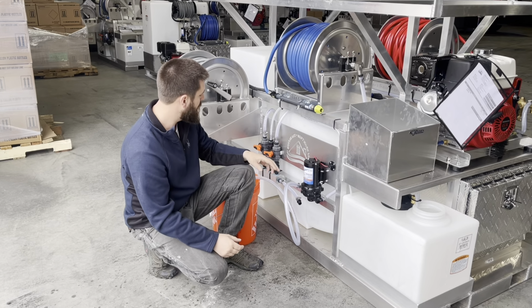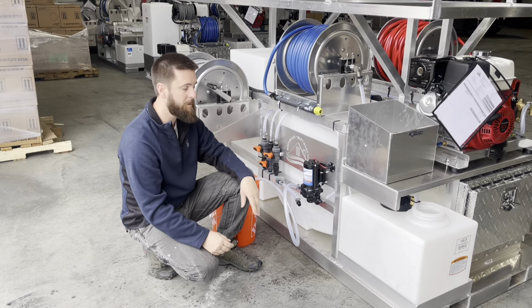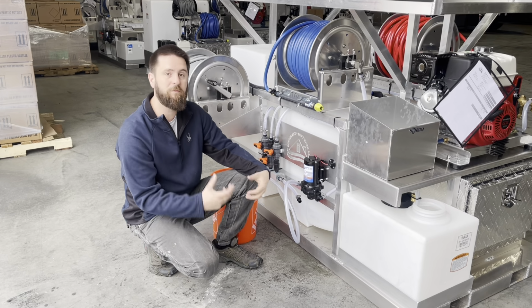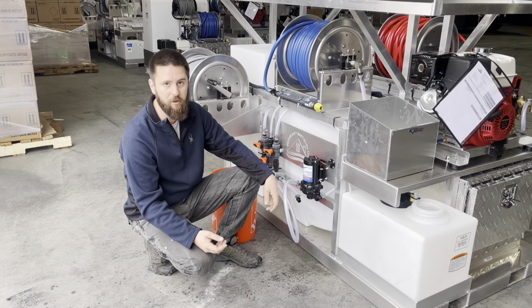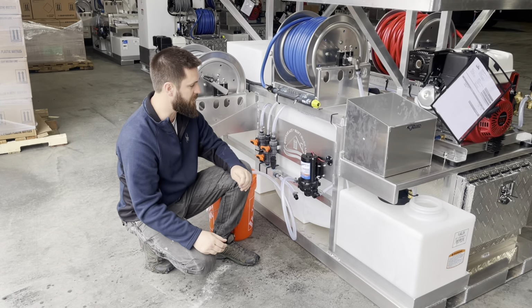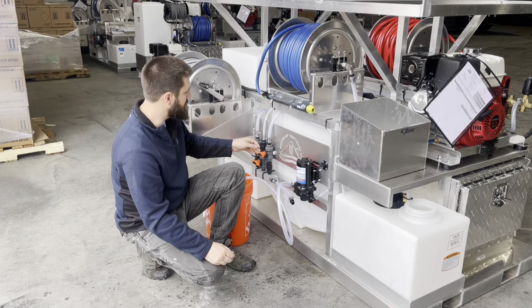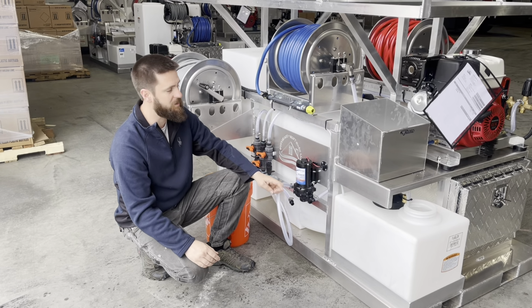Now, let's say you do this, and just like we just got the result, everything's fine. What does that tell me? Well, I've got something over here that's pulling air, and I got to find out what that is. Let's say you do this and the problem still exists. It very well could be the pump. It could be a low battery condition that's not giving the pump enough juice. So then at least you know, do I need to start looking at these things over here or these things back here? Like I said, most of the time it's a very simple fix.